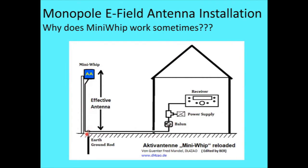The antenna is only this, but this ground wire right here on the antenna, the grounding path to the shield of the coax, is part of the effective antenna height. So even though that mini whip is a fairly little thing, the whole antenna height is all of this. It's cut somewhat effectively by the way fields cut up as shown in that one slide, but you still get a pretty good effective antenna height. And notice that's vertically polarized.